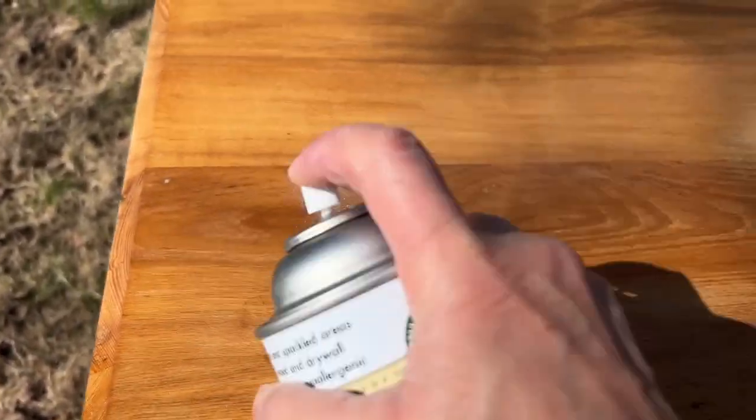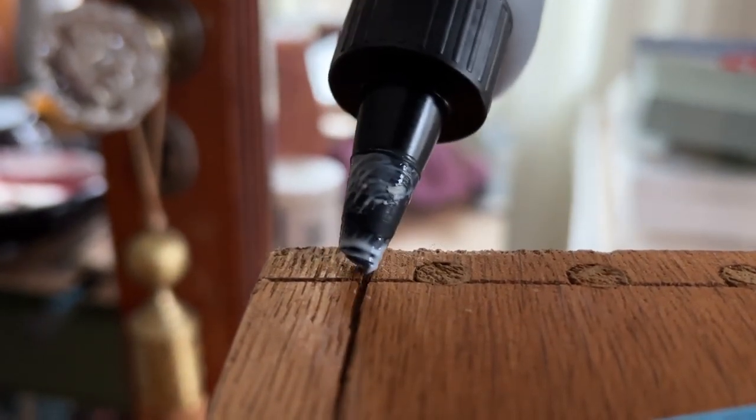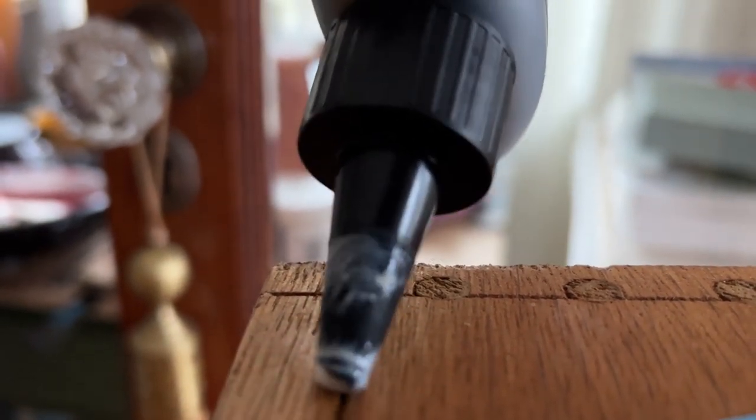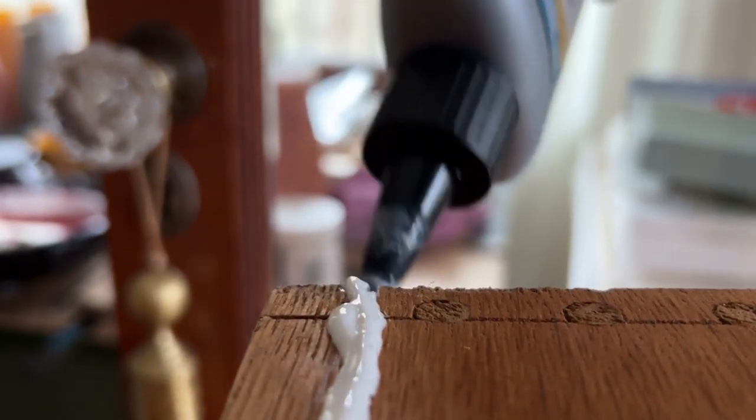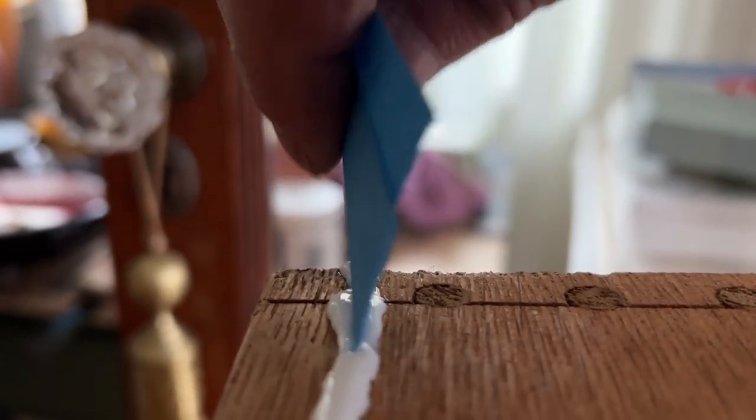I don't always use a power sander with antique furniture. In fact, I try not to do this at all, but I was gentle with it and sanded down the top and the drawer fronts. The sides I scraped a bit to get off any loose finish.